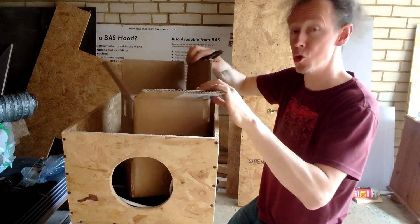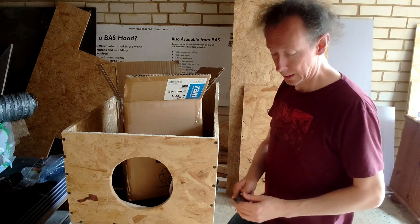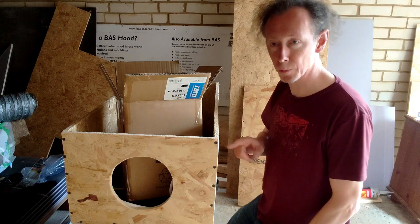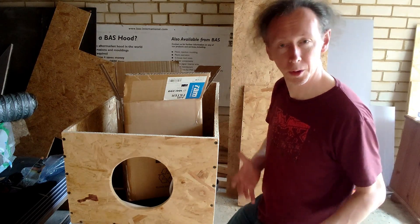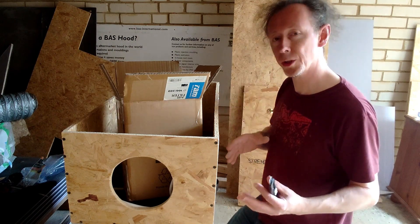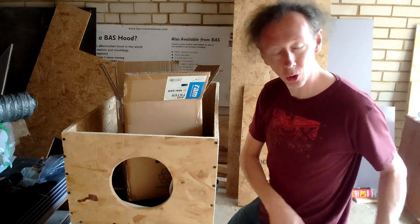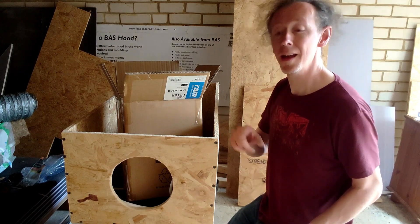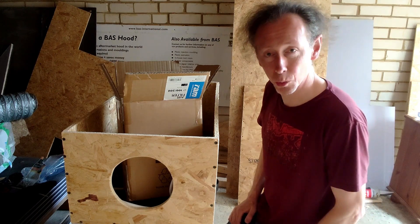The air will go into the room the booth is in and then get sucked back in through the passive inlet. I can't have a window open as that'd let too much noise in, so the air will be recycling around the room. If such things as body smells occur — you know what it's like in a closed space — it can get a bit smelly. So I've put a carbon filter on the extraction side so the air coming out will be clean when it recycles back into the booth. Hopefully the carbon filter will soak it all up.